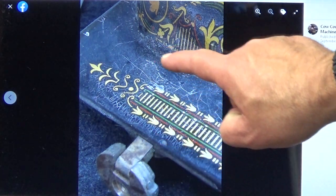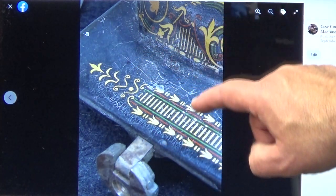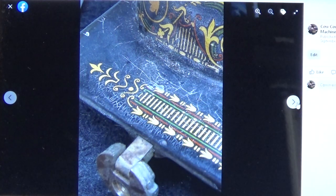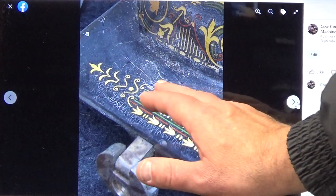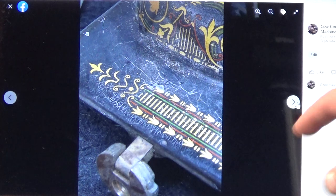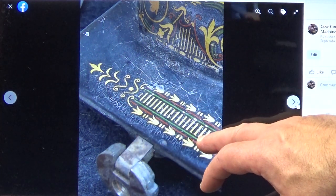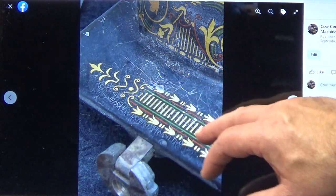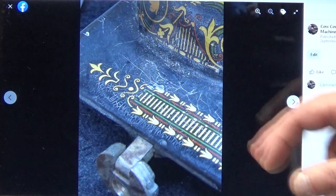And see, the challenge when you're mitigating something like this, it's not only the crackling of the clear coat like you can see here, but it's also the filth and everything that has embedded itself then actually onto the paint where the clear coat is compromised. So you're talking about microscopic surgery almost in getting all of that crud off of the surface and then preparing that surface to receive new clear coat without damaging the decals, which are, I mean, they're rice paper thin, and the only thing protecting them is the clear coat that's compromised. You see what I'm saying?